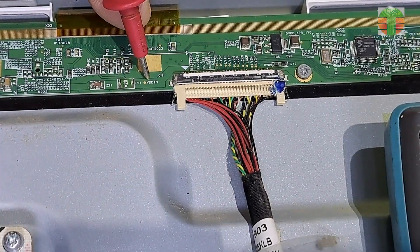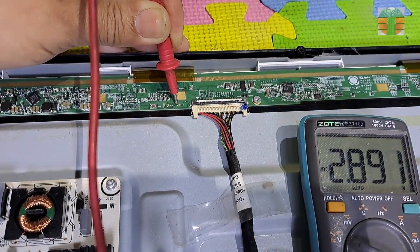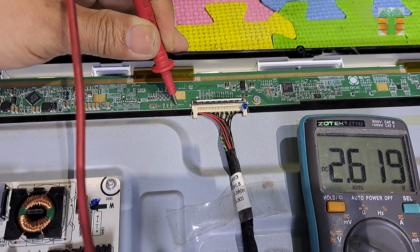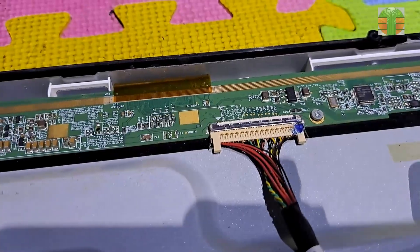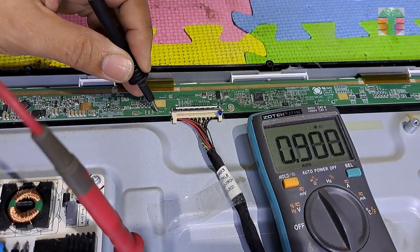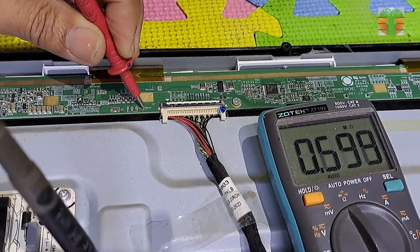Start with the VDD-IN. VDD-IN is the main supply to the panel source board. VDD-IN should be 12V but measures only 2.9V, fluctuating down to 2.6V. Seems we have a problem with the VDD 12V input supply. Measuring the resistance of the VDD-IN is important — if there is low ohms resistance, about 50 ohms and below, that would cause the voltage to be abnormal. The resistance measures about 600 kilo-ohms, which is normal.